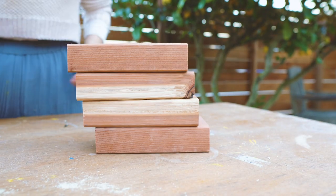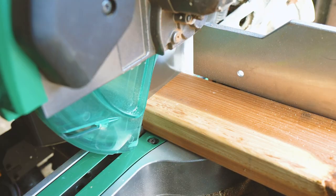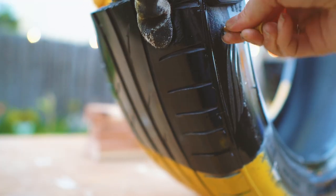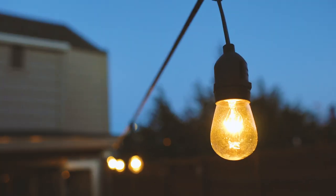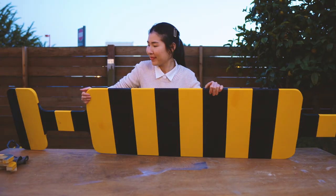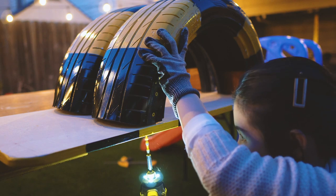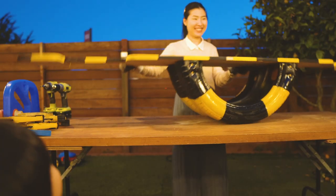We will use wood blocks to attach the tire to the center of the board. To do that, I'll measure the width of the tire and cut some 2x4 wood blocks of the same size. Each half will need 2 blocks, so I have 4 in total. I will now clamp and attach the blocks to the ends of the tire using wood screws. It's been a full long day and it's starting to get dark, but I really want to finish this project for the kids to play tomorrow. So I stayed and worked on it a bit more. I just need to attach the tires to the board by screwing from the board to the wood blocks added in the tire. These screws are very strong, so they pull the tires and the board together very tightly.